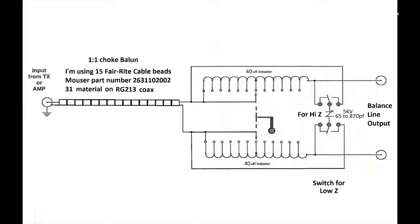Balanced line doesn't radiate because it is balanced. Across those coils I have a 65 to 870 pF capacitor — it's an SF6, which is the gas in it for insulation. A vacuum capacitor works just as well, or an air variable. When I started out I only had that on the output side, and then I found out that if you ran into an impedance at some frequency lower than 50 ohms, I would have to switch it to the input side. That's what the switch is there for. It's a very low-loss tuner — basically no loss at all.